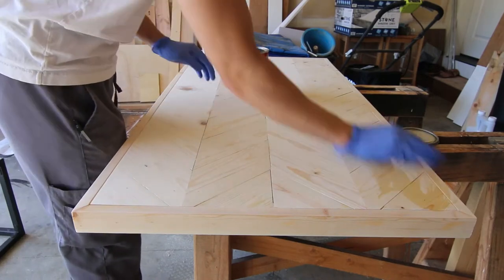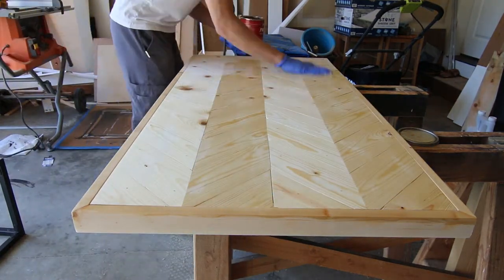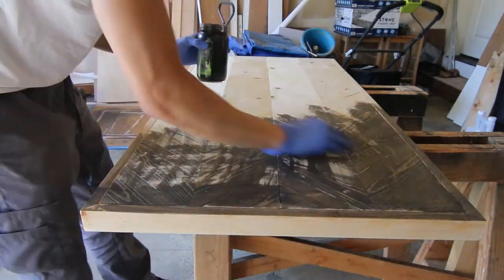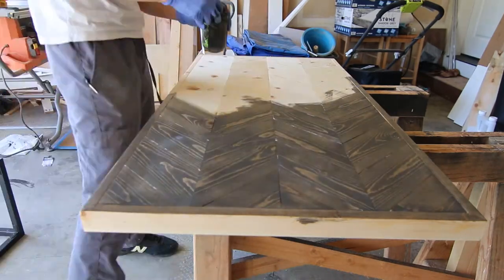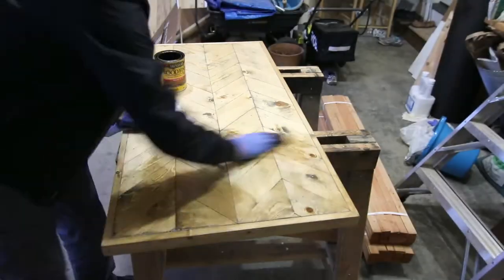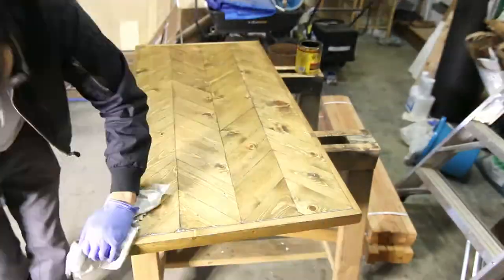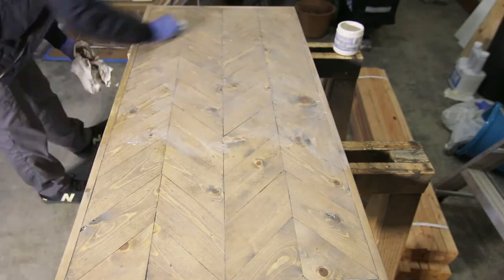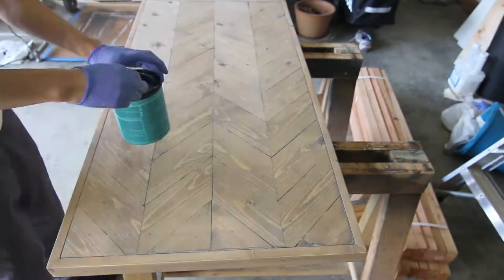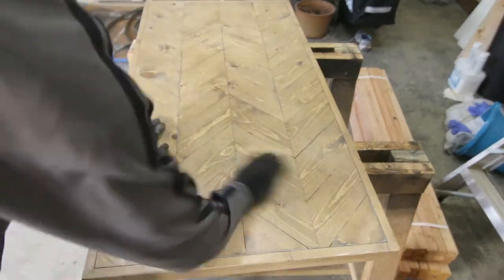Now comes the staining — I do not like staining at all, it's always tough for me. With softwoods like pine, you want to use pre-stain wood conditioner to help even out your stain. I made a mistake by using an ebony and special walnut mix and it was just way too dark, so I sanded it all off completely and started over. I ended up using natural colored Danish oil — two coats — then added Minwax Provincial on top, wiping it off as I applied it because I didn't want a super brown color, just a very light brown. Then I used a white glaze over the Provincial to make it even lighter. For the final coat I used poly acrylic polyurethane water-based sealer to finish it off.